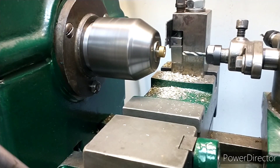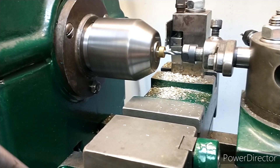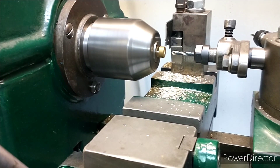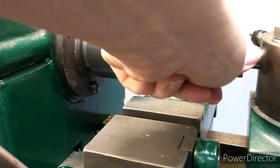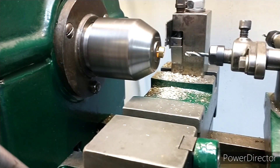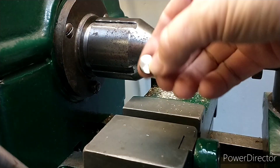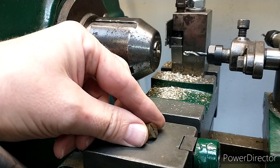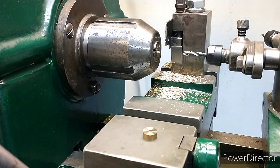What you can see there is that the drill hasn't quite gone through far enough — the parting blade has gone through but not the drill. So what I need to do is adjust this end stop here, and I'm going to do that in real time. The hole hasn't gone all the way through, so I think we need a bit more length on the drill. As with all these things there is a bit of trial and error.